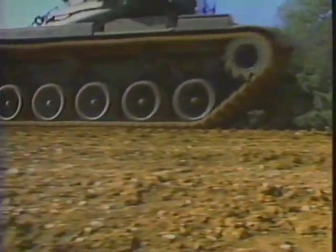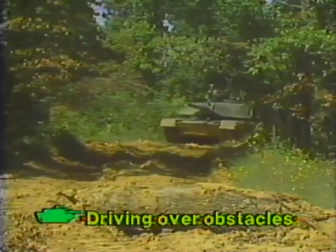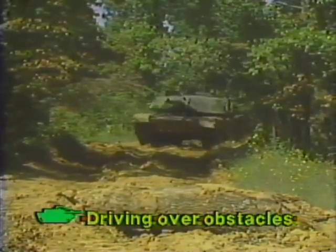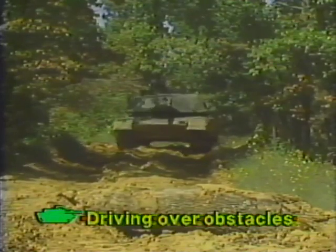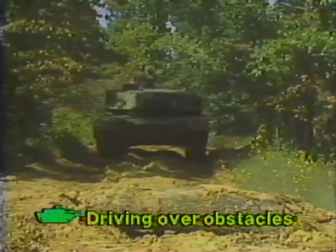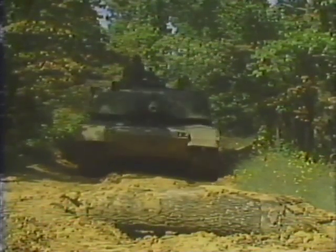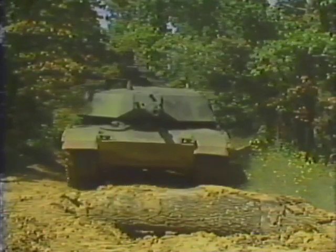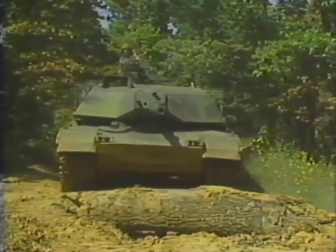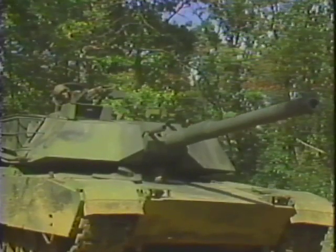Such obstacles as stone walls, shelves of rock on a hillside, and similar terrain features cause difficulties in driving unless you learn to deal with them. To prevent personnel injury or track and suspension damage, cross obstacles slowly. First, the TC must alert the crew that an obstacle will be crossed, and the main gun must be elevated or traversed to prevent contact with the obstacle.